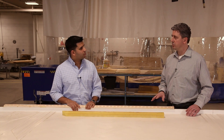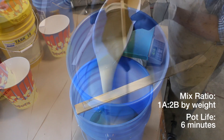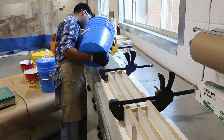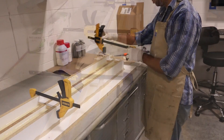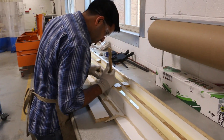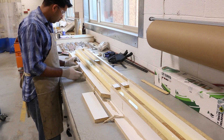For this project we used TAS-16, which is a Shore 80A hardness rubber. I'm familiar with PMC 780, typically used for concrete stamps — why use TAS-16 here? What makes it different is the 90-minute cure time. PMC 780 has a 48-hour cure time, but with TAS-16 you're able to make more molds faster and have them ready for production.